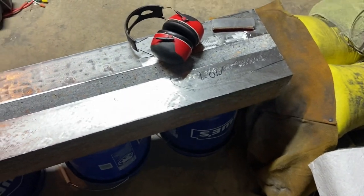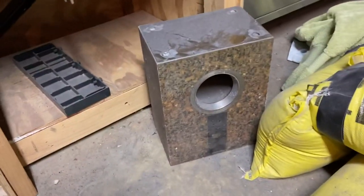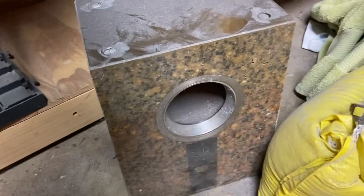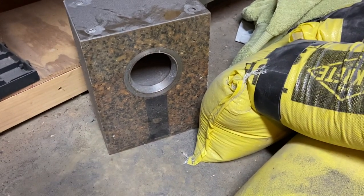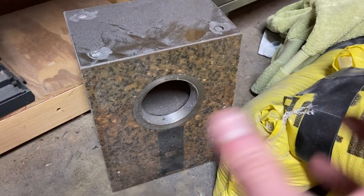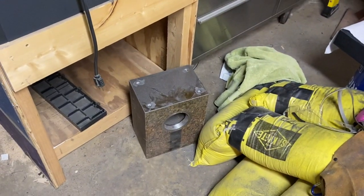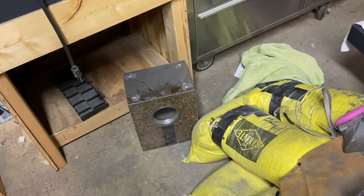This angle grinder method has been reasonably effective so far. And then over here I've got the headstock casting. You can see there's a half inch wall by about five inch diameter tube in there where I used the lathe at school before I graduated to cut out the two slots for the tapered roller bearing outer sections. They're both compression fit in there. The rest of the spindle is put away right now — just didn't want to get too much dirt on it and I'll clean it thoroughly. I don't want to deal with replacing those bearings if something goes wrong.